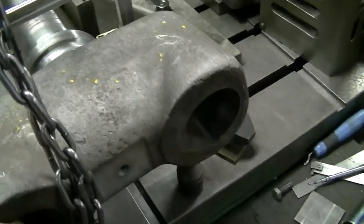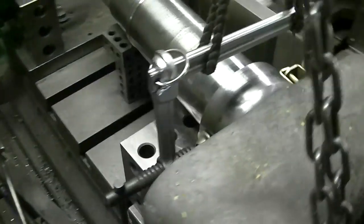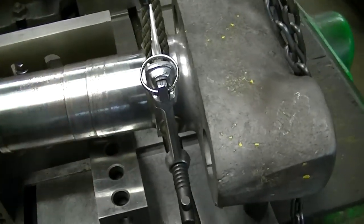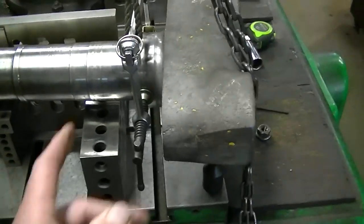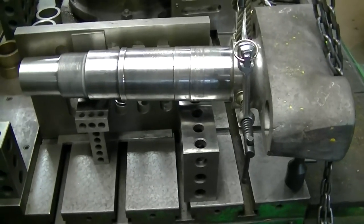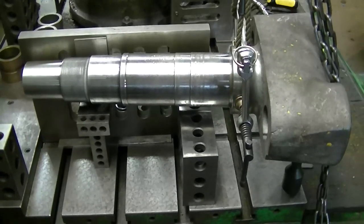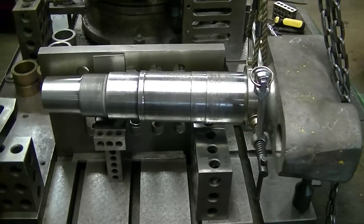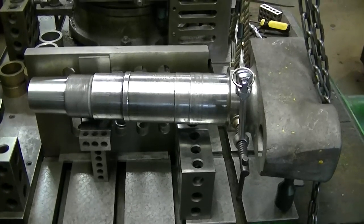And I'll get a little pad stuck back here behind this shoulder. There's a little radius in here that I've got to stay clear of the corner and pull everything back. And then since I'm going to be drilling it, I have to account for the Z, and I'll have to clamp it up and pull it up against that knee to make it solid. It should make sense when I'm back and getting ready to machine. So we'll shut it off and get set up and get things clamped down and give her a go.